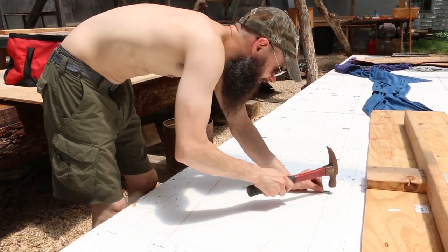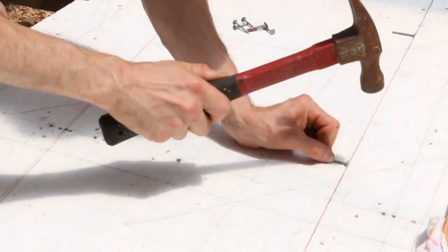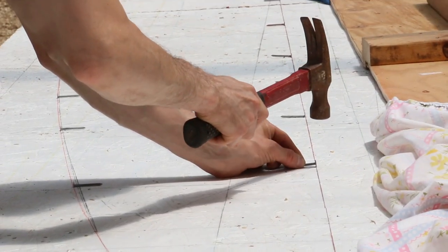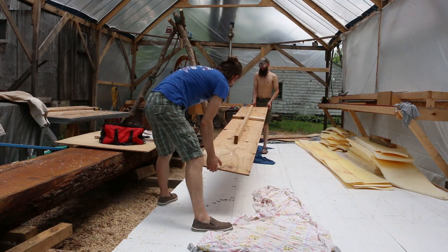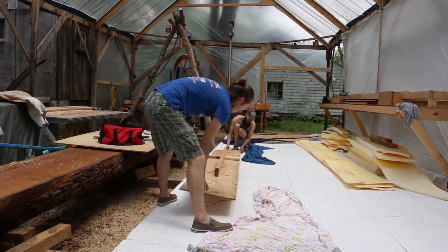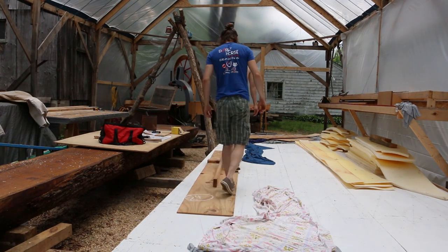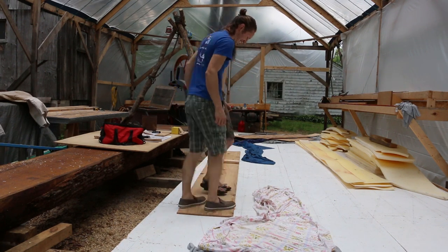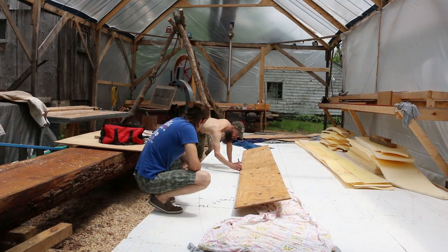You place the nail heads in the lines that you're using, and then you imprint those nail heads into the plywood that you're using and connect the dots, just like you would as a kid. First, you start by placing roofing nails head side into the line. Once you've done this across all the lines that you need, you place your plywood over those nails. Make sure that you're covering the entire design. And then, you just walk on it. The printing dance. This will imprint the nail heads into your plywood and leave you some divots that you can find afterwards.